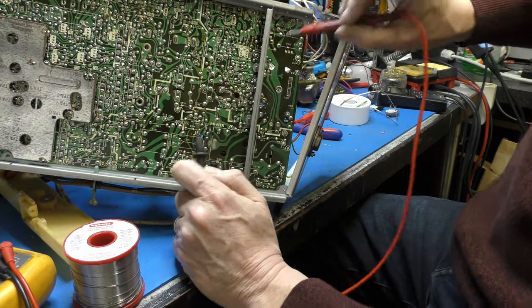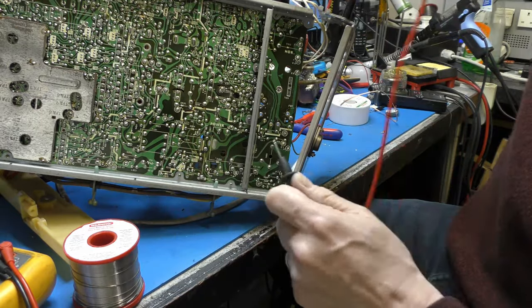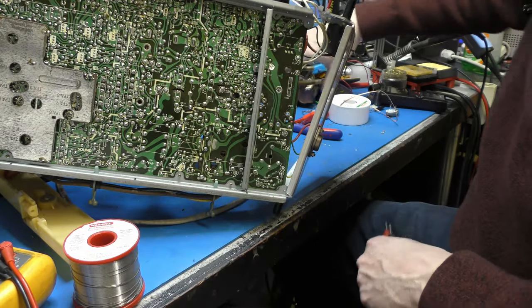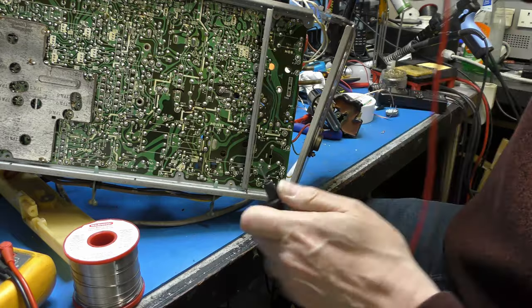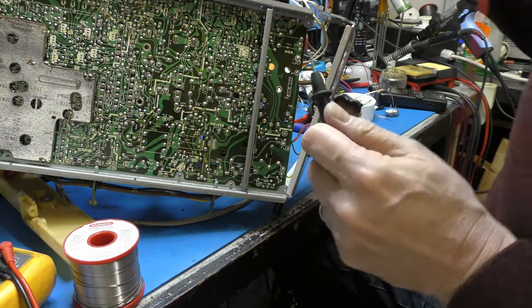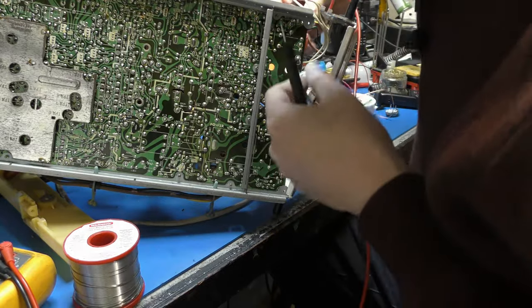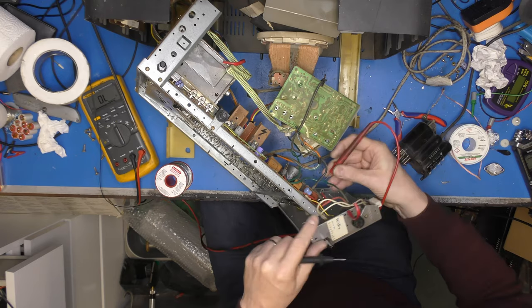Also goes up here, yeah, for the line drive, I suspect. Yeah, it's a line drive transformer. So we need to look at pin 4 on our output transformer, but we know it's going to be all right to ground. Where is the transformer grounded is our next thing. Where's our collector connect? So let me find that wire. It's that red fella there with a tag on it.